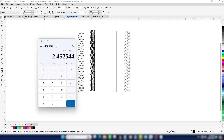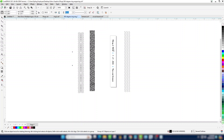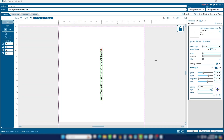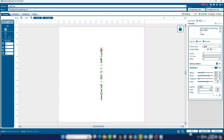Multiply the interior diameter of 0.784 by pi and that'll give us our page height, showing us how far around we can go with our text. Set the page size to that height, drag the text in, center it, and make it a bit bigger if desired. We're going to mirror the text horizontally because since we're engraving on the bottom of the ring, this is necessary for it to be readable. We'll print that selection only. The settings stay the same in the dashboard — all we need to do is change the rotary diameter to 0.784, so don't forget to do this, as this will turn the rotary at the right speed. Then print that to the laser.